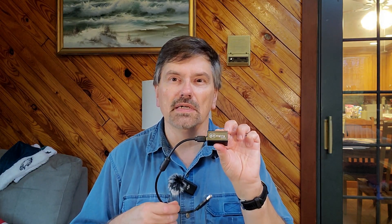If you want to run any of the digital modes, the 7300 is really handy — just connect a USB cable to your computer and you have the sound card interface. The 7300 was designed to make that very simple, and it appears the new Yaesu FTX-1F coming out early 2025 will have that same capability. The ICOM 705 also just needs a USB cable. My FT817 doesn't have that, so I use a Digirig to connect it to the radio, which gives me CAT control as well as the sound card interface to run FT8 and any other digital mode. The same applies to the FT818 family, and Digirigs are designed to be very generic across many different radios — there's even a new version specifically for the Yaesu FT-891.